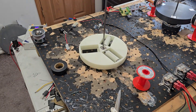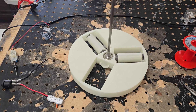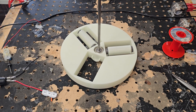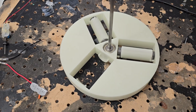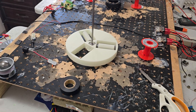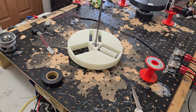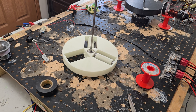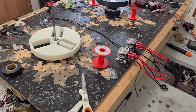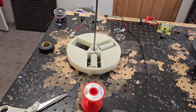If the shaft has to be attached to the rotor, it's a one and an eighth inch hole, so that would be the size of my shaft — one and an eighth of an inch. I don't see how that's going to happen right now. The commutator's got to be adjusted a little bit because it's got to attach itself directly to the rotor. I know already there's going to be some differences, so it's going to be all right.